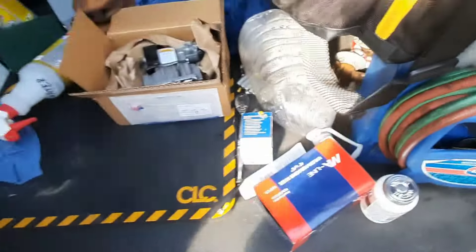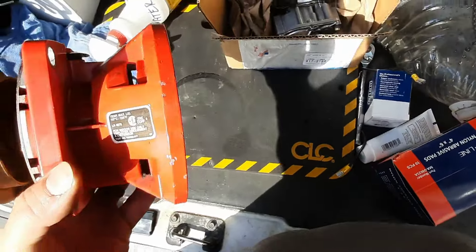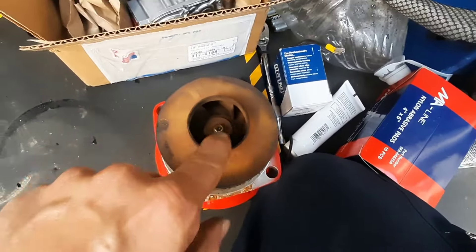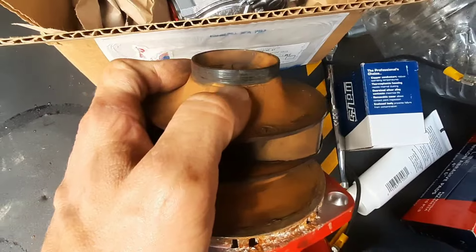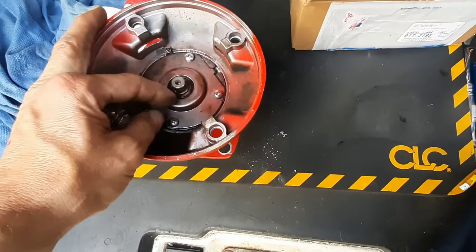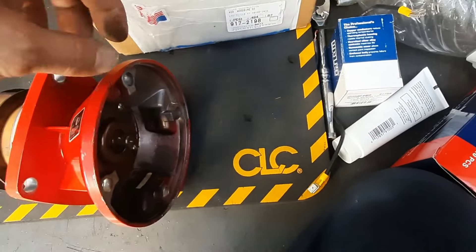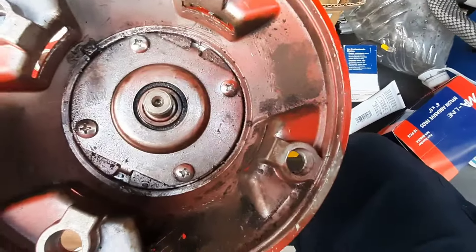This is just a quick one, guys — I just wanted to show the pump rebuild basically. These things used to scare me and I'm not a fan of water anyways, but it's a pretty simple deal. Bearing assembly, the impeller — there's a spring inside here and usually a nut on top. I couldn't get this one off; the nut came loose, but then there's a small hairline crack right there and another spot as well. It was leaking around the seals anyways. This is the shaft — the coupler connects that shaft to the motor shaft. It's just a spring with a little set screw on each end and it allows the motor to spin the impeller.